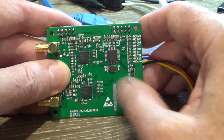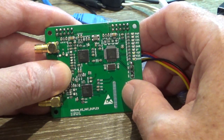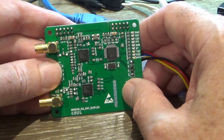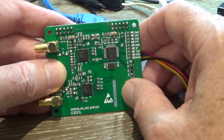For UHF they usually run better with a split — I run them on a 5 MHz split, which is consistent with the 70 centimeter band, and they work great. But there's a difference in the way they operate.